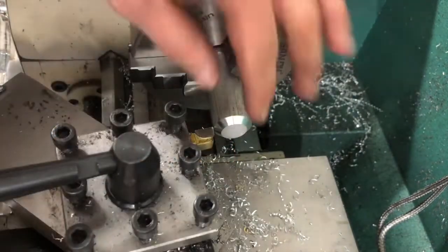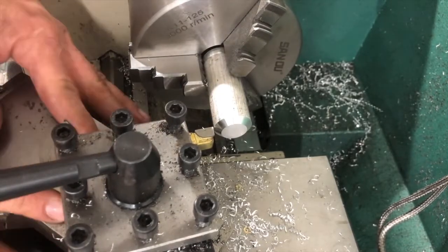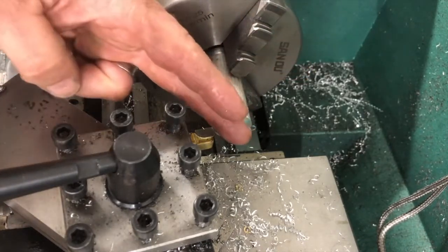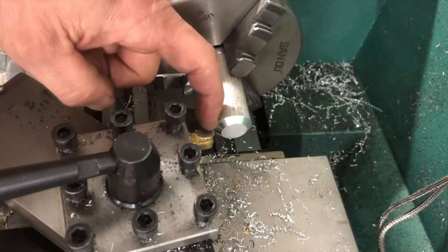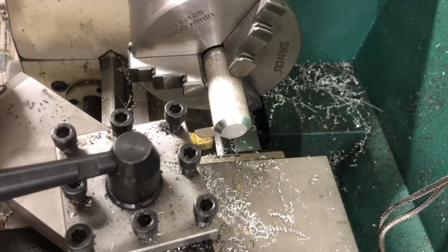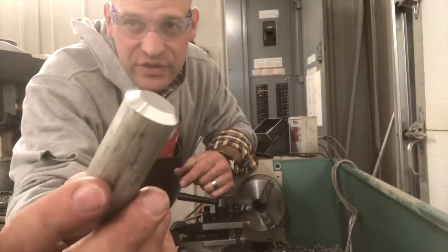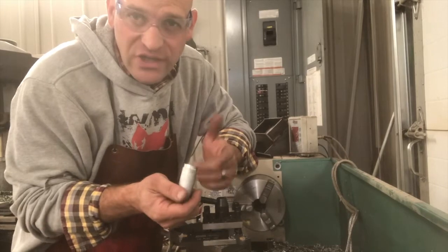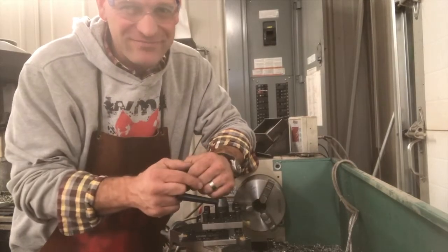Alright, so now we have this nice taper on here, and you can take it as far as you want. That is how to produce a taper — you're going to use this compound slide and go back and forth. You can cut going forward and also going back depending on your cutter head. If you have a cutter like this where it has cutting on the front and the side, you can cut both ways, forward or back; you just have to remember to turn your cross slide when you do that. So there you go folks, that is how to produce a taper on your parts and pieces that you are creating on the lathe. Thanks so much for watching, and remember folks: work hard, because hard work is its own reward — it is valuable. Thanks for watching.